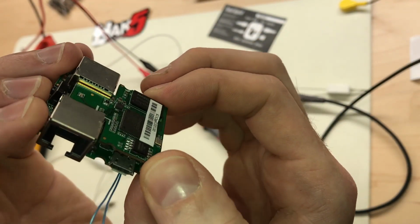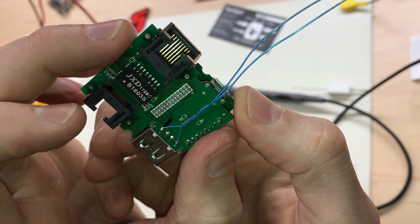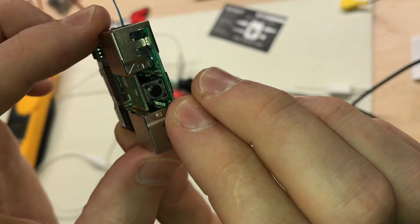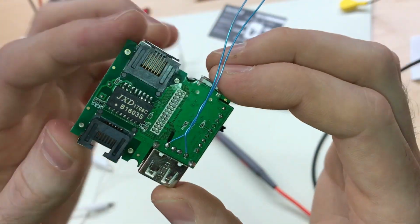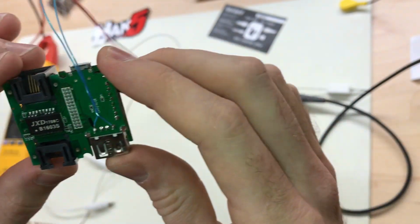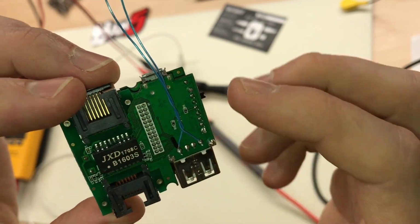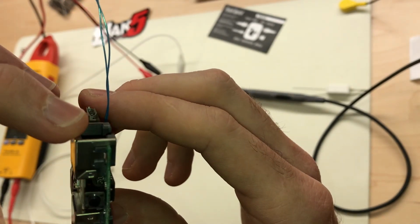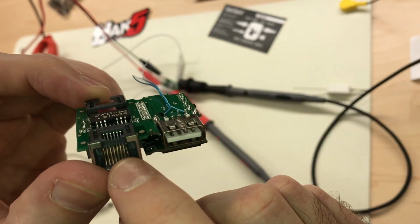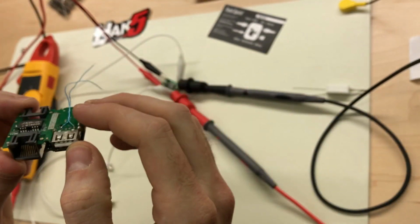And unfortunately, this little motherboard, the riser board on here, it's soldered on as well. We could unsolder the header right there, but it's a pretty small pitch header, and I just really don't want to do that. I want to modify this as little as possible and even make it to where we can unmodify it if we want to remove the POE feature. So I'm going to use the multimeter again and see if I can find those pins up here on this transformer. I hope/think they are there, but if not, we'll keep looking and see if we can find somewhere to get to these pins, maybe even inside the case in the back, routing the wires through this crack, possibly. So we'll figure that out.